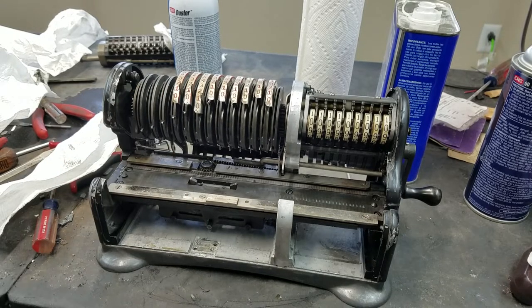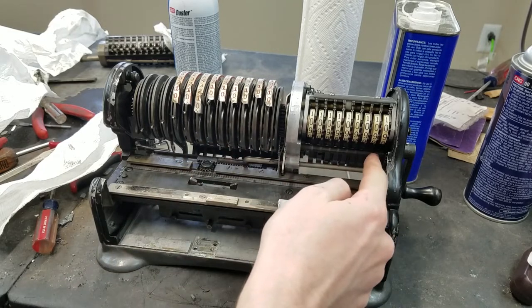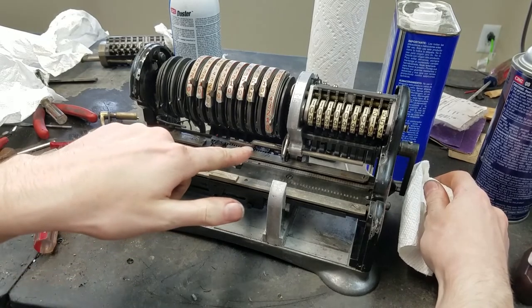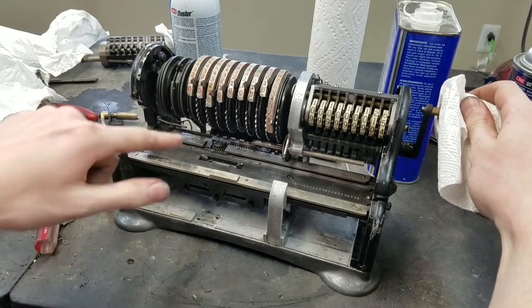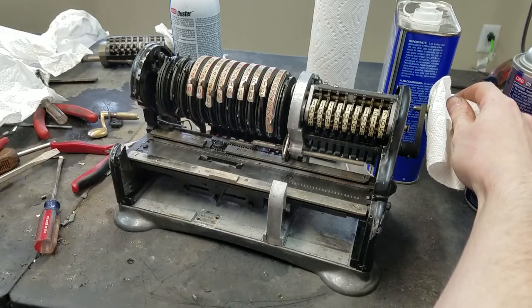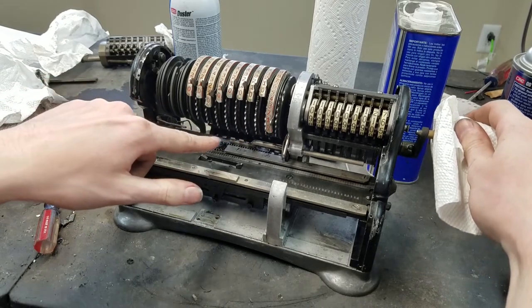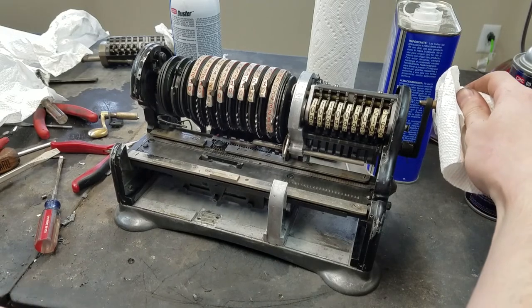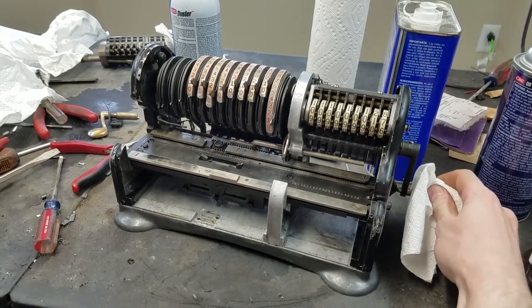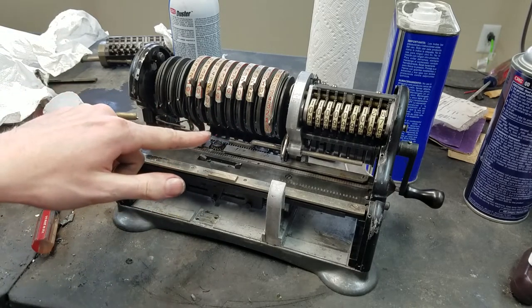I think the next step is going to be taking a look at the carriage, just cleaning it up a little bit and putting some oil on it. Then we need to time the carriage with this piece so that the counter finger lines up correctly with the drag gear in there. While I have the carriage off, you can kind of see the moving segment action. As I rotate this around, see how these pop out? Now these ones are going to start falling in because they've added what they're supposed to add, but this one's set to like eight or nine so that one's still out, and then it falls in all the way down at the bottom after it's driven the full length of that moving segment. Like these ones pop out up here, then most of this rotation is missed, and down here is where they would start driving — they're only going to drive like two or three teeth and they fall back in. You can watch the Marchant XLA series where I took this whole thing apart.